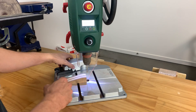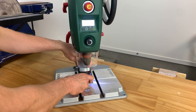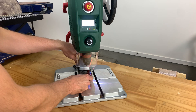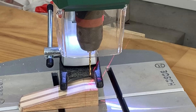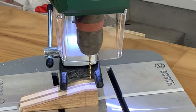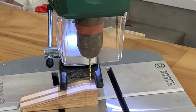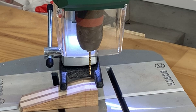From there you need to clamp it down. My drill has its own little clamping system. After you've done that, make sure the drill bit is actually going where you want it to be — just bring your drill down and touch the timber, making sure it's meeting that central X spot in the center. Then begin the process.